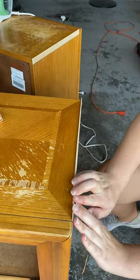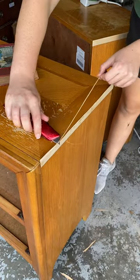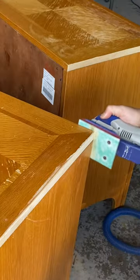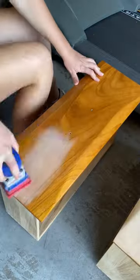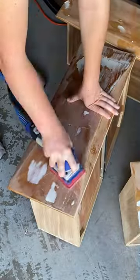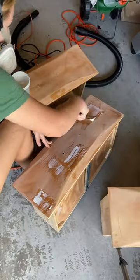To remove the excess edge banding, I just bent it over and then grabbed a razor knife to shave off the excess. Then I sand it down smooth to make sure it's perfectly flush. I always go in with 220 grit sandpaper to scuff the entire surface before I do any prep or painting. To fill any small nicks or dings, I use a premium wood filler and then sand it smooth again with the 220 grit sandpaper.